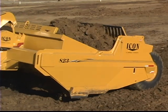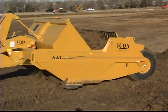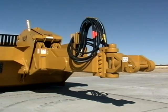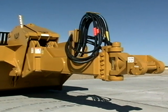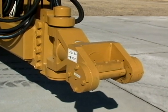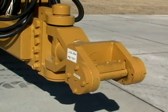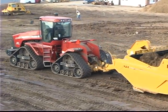Built tough to withstand heavy use in rugged conditions, the 800 series feature a 12 inch by 12 inch hitch beam fabricated from high tensile one half inch steel. The massive hitch beam is coupled with an ultra rugged quick hitch that has been designed for the stress loads imposed by 600 horsepower tractors and challenging soil conditions.